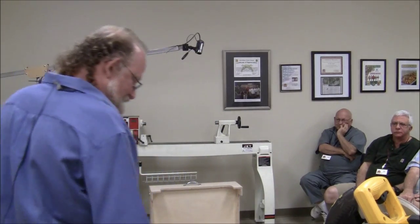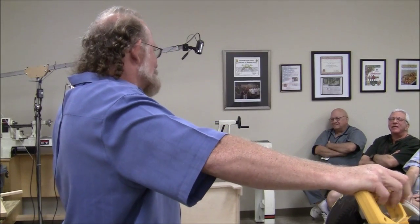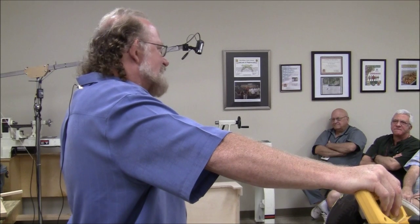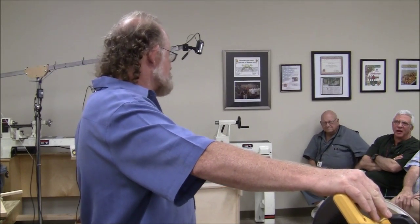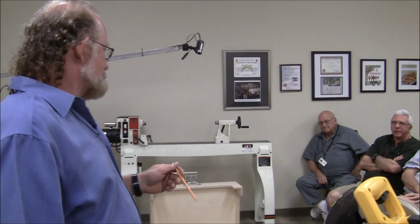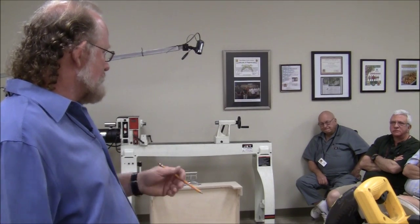One thing I found out with this six inch crown — I tried to drive nails into the plate and it's going to snap. Yeah, it breaks right there. So that didn't work out, I had to change. For six inch, would you run floor blocks between it — what they call a cant strip? I've only done that on one job my whole life, and I've seen a lot of crown run without it. I wouldn't run it unless the building spec says so, because on a new house you're going to be able to locate your joists and studs for solid nailing. On this job I actually had a cant strip because I was going over top of four inch crown — it was two stories up so I couldn't see the four inch crown from down here. This new crown fit right over top of it, so I was able to nail into that old crown without having to look for nailing.